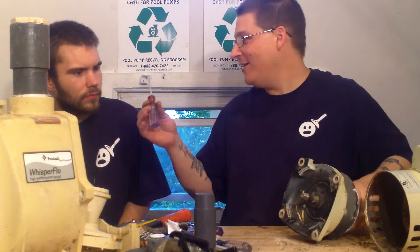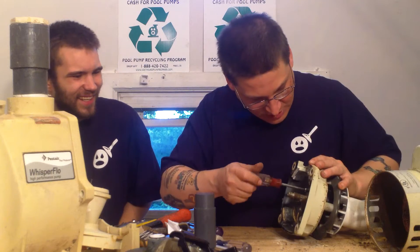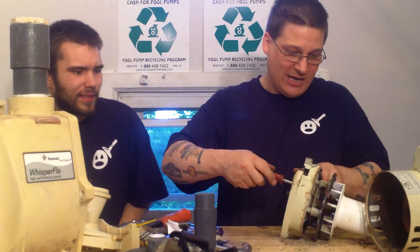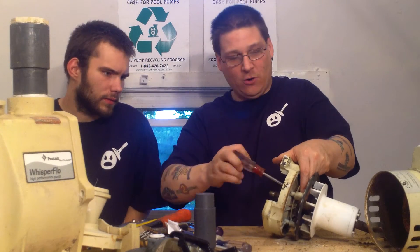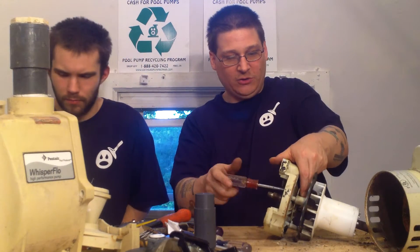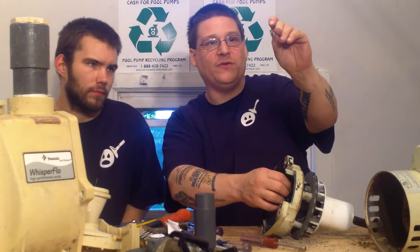So what you want to do is get a nut driver. This time we have the right nut driver — not like the other videos where I was like, wrong nut driver. You want to loosen this center screw here, as you can see with the nut driver. Put your finger in the back here. There's a little bearing retainer back there that holds the ball bearing, so you want to loosen this nut right here. Then this little piece will slide right out like so with your finger.